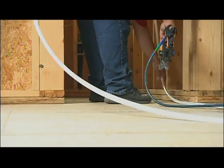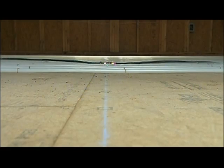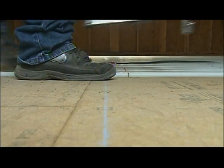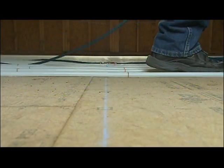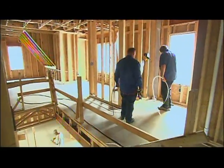You're not using any connectors here? No. We don't want to have any splices anywhere in the floor unless something actually hurts the tubing — we try to avoid having any splices in the tubing anywhere. What happens if somebody does pierce the tubing once it's in? Then you have to give us a call and we have to come back and splice the tubing and protect the splice joint. Something we try to avoid at all costs.